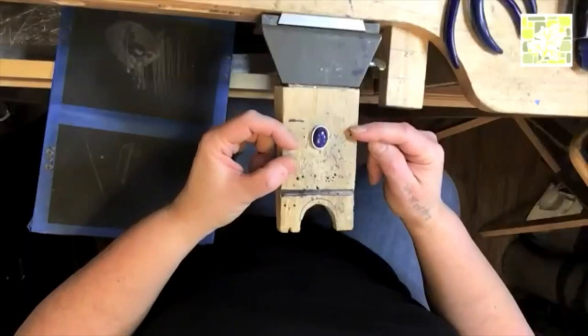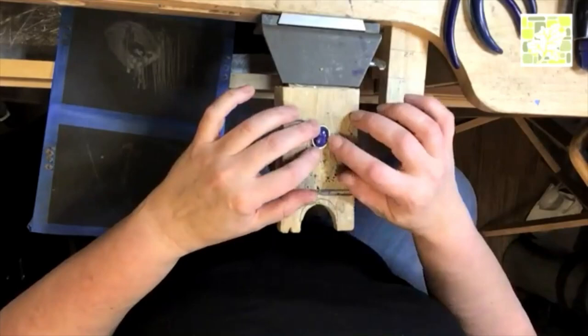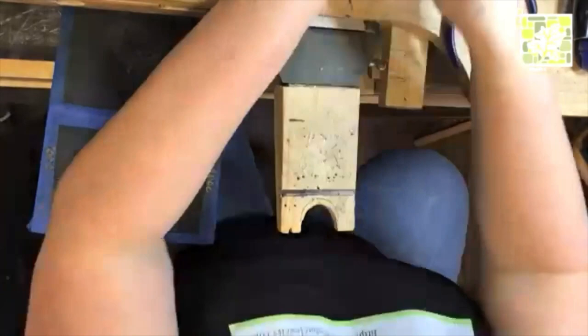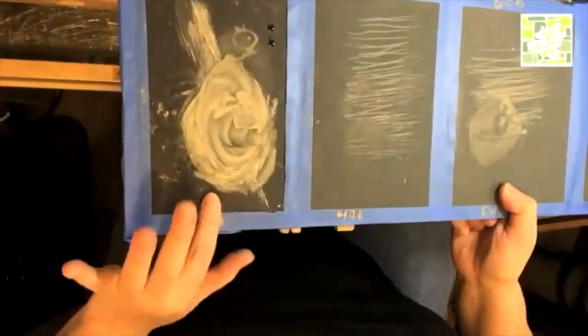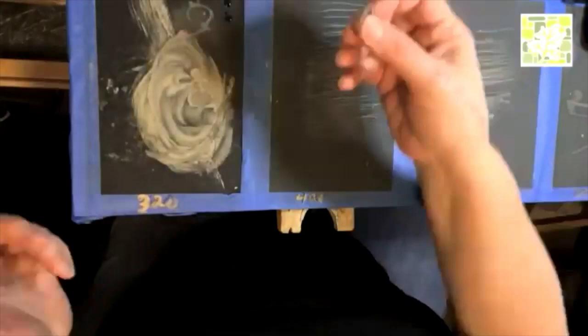And the other thing that we're going to do is file down the upper lip of it because it's pretty well sized because I sized it well out of the gate. I've sanded it down on one of the sanding boards that John recommends, which is, again, a piece of plexiglass. I've made mine as one giant board because I happen to have a big old plexiglass piece. And I've got it set with different sizes. So I go from my 320, 400, 600, 1000, so that I can just work my way through it. John recommends in the book a wet dry sandpaper. So again, I just have a little thing of water that I'm dipping it in to do my sanding work.